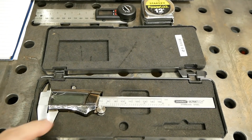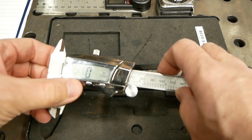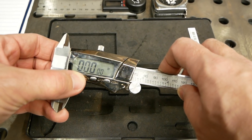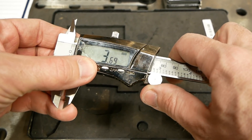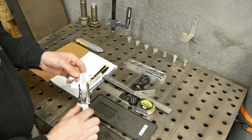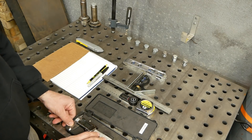A set of digital calipers. These are super useful — I use them all the time. They actually have three different modes: fractions, millimeters, and thousandths. So you can bounce back and forth, especially if you're cutting parts for something on a metric machine like a quad. You can actually measure metric and then figure out the standard equivalent. I would highly recommend getting these if you're going to start drawing in Fusion 360 — it really helps you out.